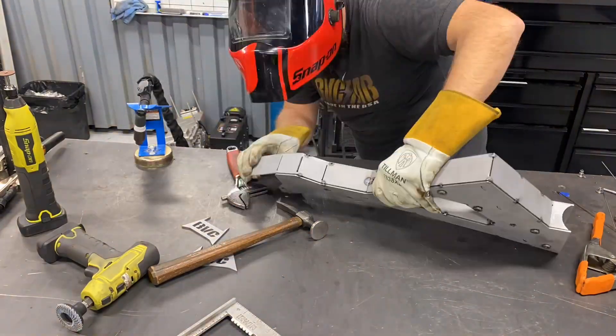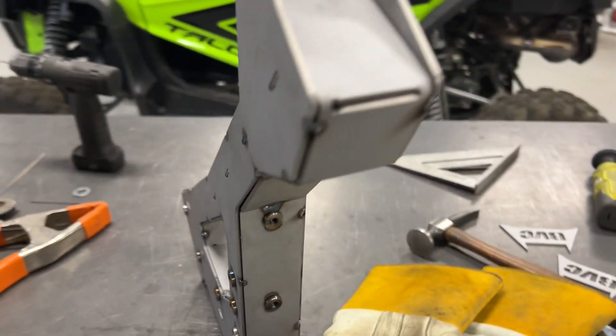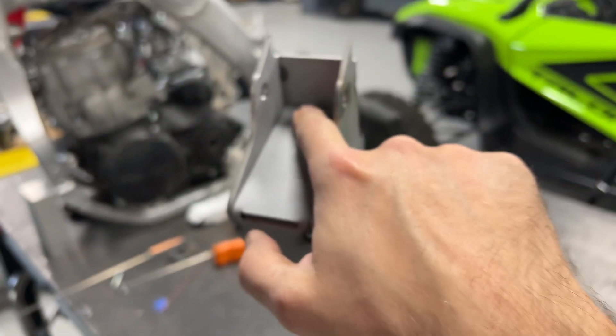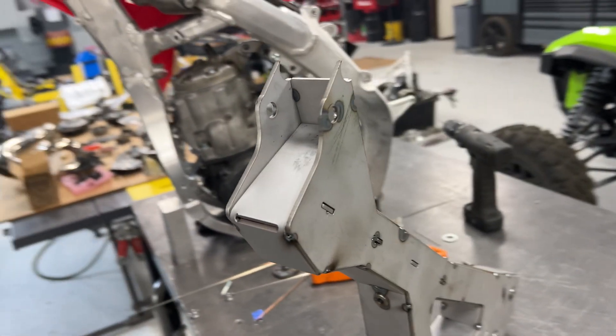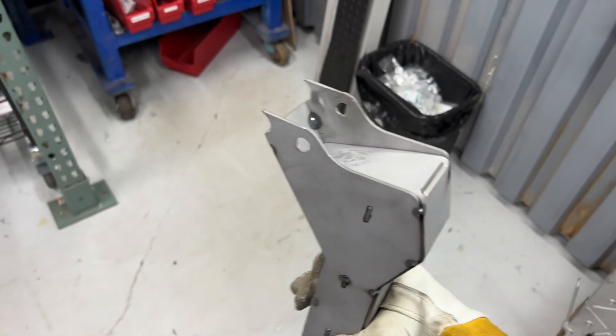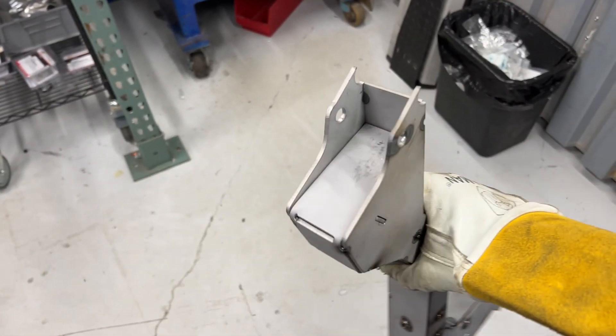Right here I'm just finishing the top half of the frame. I made a nice wraparound in the back — I was a little bit paranoid about the shock mount area — so I was able to actually fold that piece of metal up and inside, adding some internal bracing right there. Now all these mounting points on the rear shock bolt mounts are actually going to get external gussets welded on the outside, and we're also going to have some bungs welded on the inside. So this rear section is going to be extremely strong.